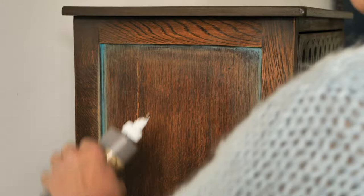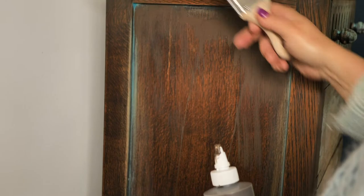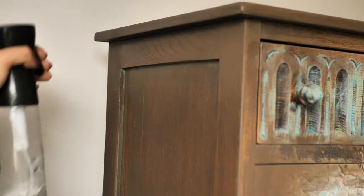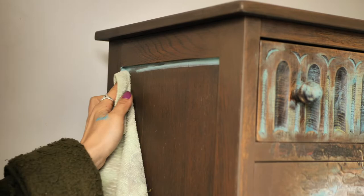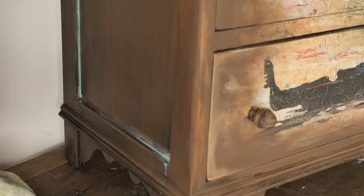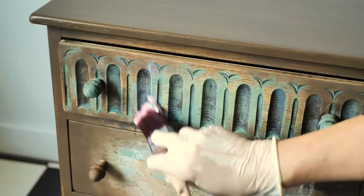Let's move on to working on the side and top, applying Voodoo Gel Stain in Tobacco Road to give this wood a tint while leaving it to peek through. The Tobacco Road has a similar shade as the brown paint I used, so I decided to apply the gel stain instead of doing a color wash with Chocolate in order to get the same look — it's just easier. After the gel stain dried, I applied Gulf on every corner and edge and, with a damp cloth, wiped it, leaving behind a stunning look that's matchy-matchy with the forest drawer on the front. I let it dry for two hours and it was ready to be sealed with flat clear coat in three layers, letting each coat dry for two hours.